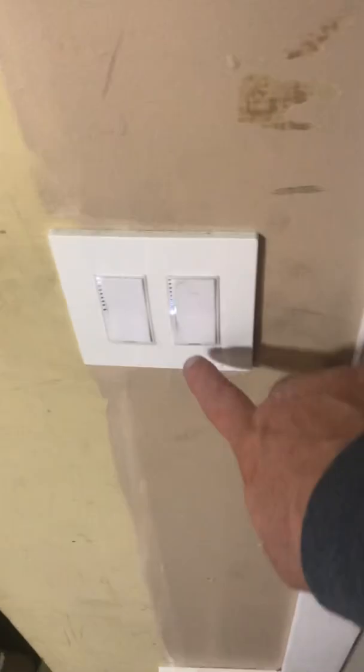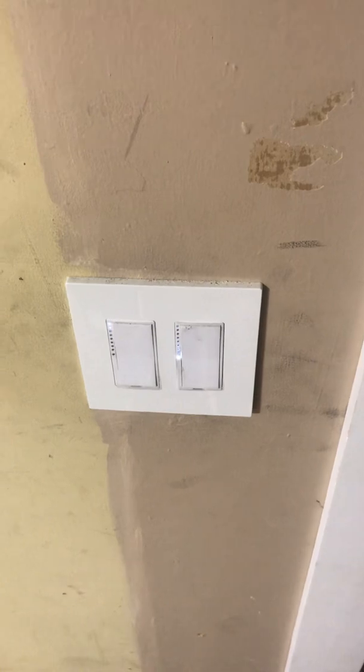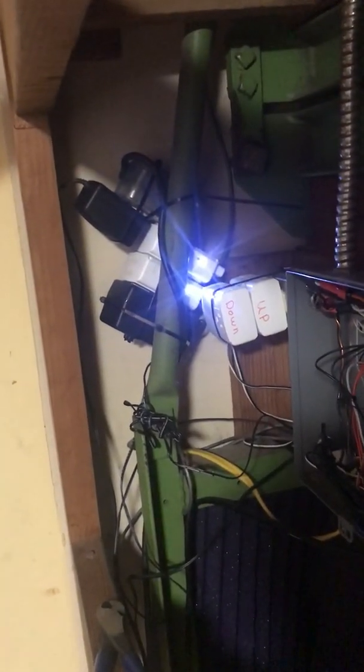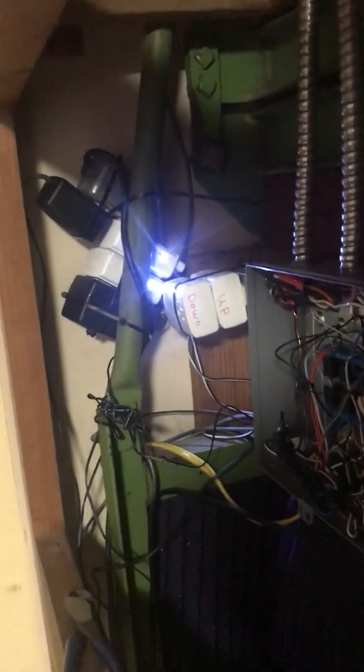I can call the cab from here but I can't do it if the door is open. If I try to send it up or down, nothing's going to happen because it changes the status and opens up the common leg of my control wires on the winch. You can see the top one is on, but as soon as I close the door the other one powers up — now it'll allow me to operate the winch. And I can't open the door because it's now magnetically held.